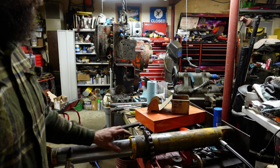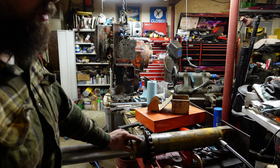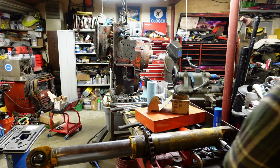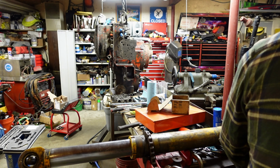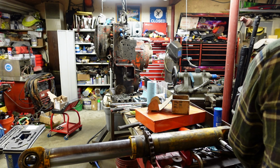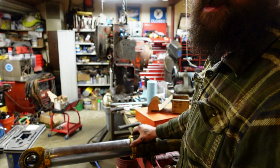I just want to make sure this O-ring's seated properly, and a little bit of air will tell me that. If the O-ring's not good, it's gonna leak, and if it is good, it should be good at a lot more pressure than this. Pretty confident it's good, but you see how it jerked pretty hard when it went? It went 1.25 inches, but we're holding, so I'm gonna call this good.